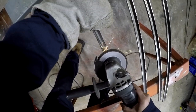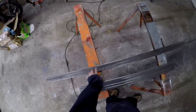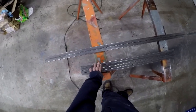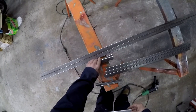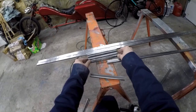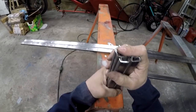I need to smooth them out and get rid of those rough, sharp spots. Now I've got C-channels for my cross members and C-channels for my mainframe. I decided on a 23-inch deck — four for my main beam there, the rest for the tail section — and seven-and-a-quarter inch width of my rails. So I'll cut these and then just line them up. They all need to be the same, so I'll fix that next.